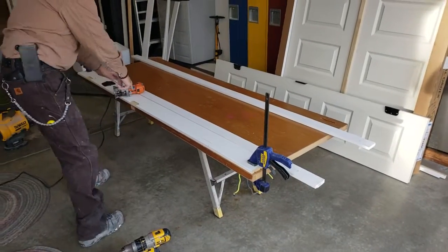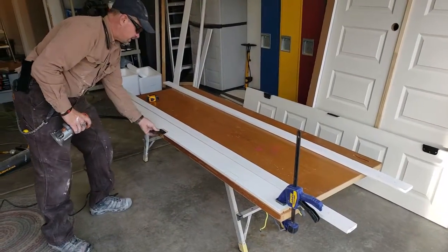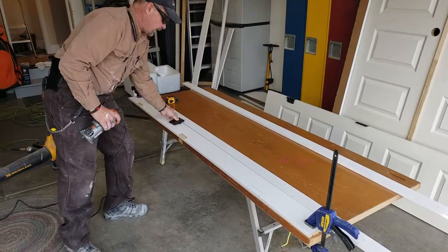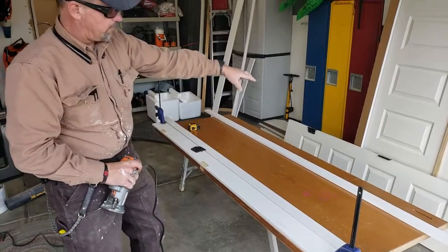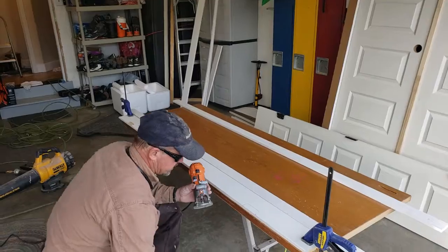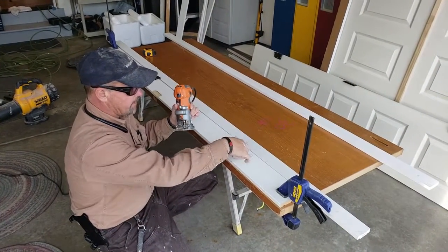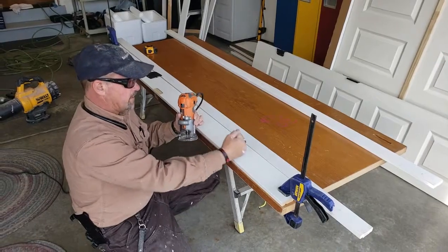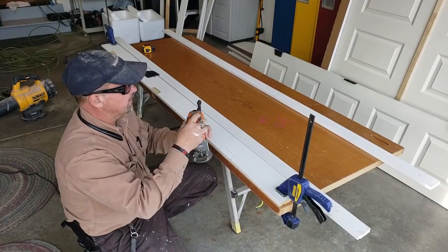So I'm going to start — it's going to be kind of noisy. We've already done two of them that you can see here. These are mortised out so the hinges fit in there just fine. We have them set back at an inch and a half reveal so they line up with the frame of the door we're going to be putting on. Unfortunately, they don't make a template that we can really use to guide the router, so we have to kind of do this by hand.